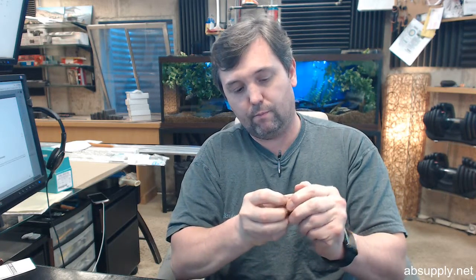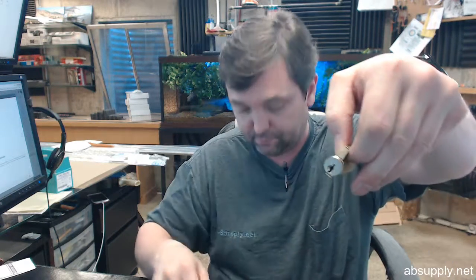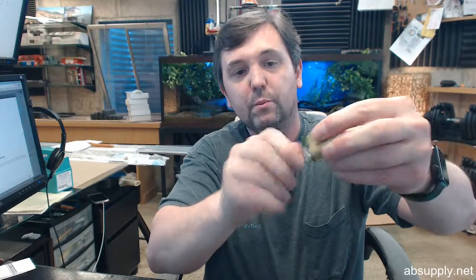I'd like to remove the key at this point. I might use my spanner wrench as a little lever to pull the inner rosette off, and then at that point I can just circle around and pull that off, get my fingers underneath there. Or, in some cases, use the tool again. Okay. And your knob comes out. This would be appropriate for you to do also if you need to rehand the lock.